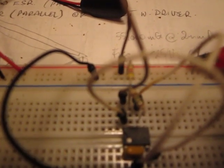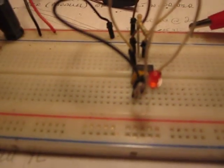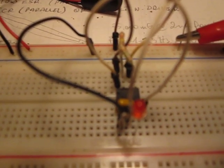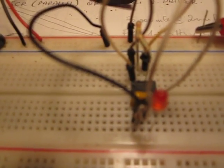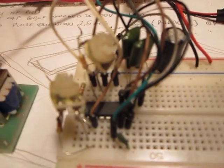I have right now a 1.5 meg resistor, so that's a lower pulse rate, and as an indicator I use an LED with a 470 ohm resistor in series plugged between pin 1, which is ground, and the output pin 3. So that's a pretty simple test bed. You can test your 555 and adjust both resistors, and then you know for sure that when you transfer them to PCB you have no surprises. And the same thing can be done with the 556. So that's a good idea, much better than unsoldering components and possibly ruining the PCB, because you will have a faulty component.